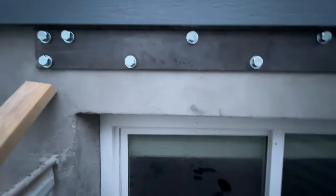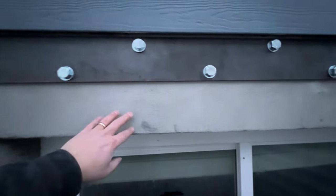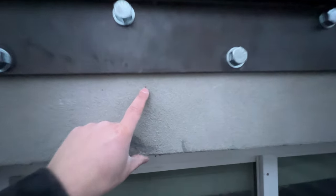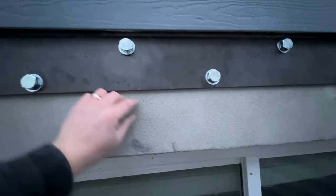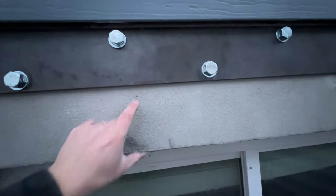The reason we need to do this is because this concrete header is going to need to be cut out. This mark is 83 inches above the inside floor of the basement, and that's the height we need to get a door to fit here. This just fits perfectly to give us about an inch of space between this and the actual door that's going to go in here.